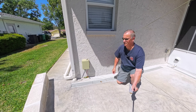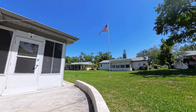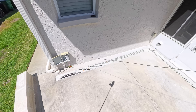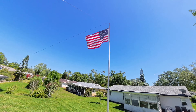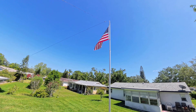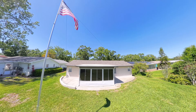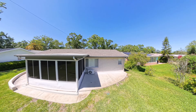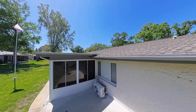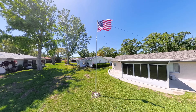I've decided to simplify the video and get out here and show you. This is the polymer box — there's enough space in here to store my wire, so if I need to quickly take down the portamast and wrap up my wire, it all goes right in here. We can see the box and the wire going up to the very top of the portamast. Because I have a piece of bungee at the very top, the flag stays away from the wire. It is a sloping inverted V multi-banded antenna and it's working phenomenally for me.